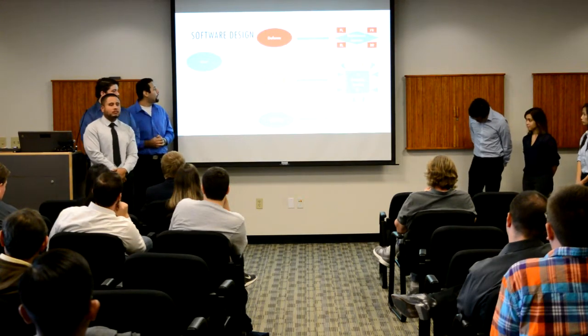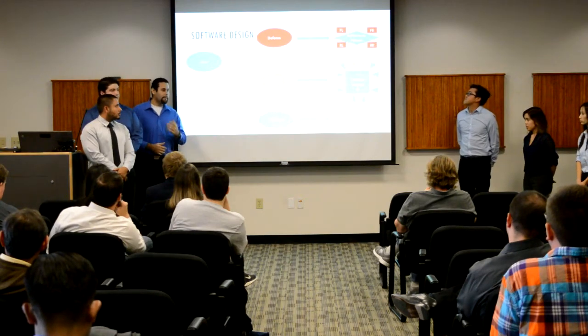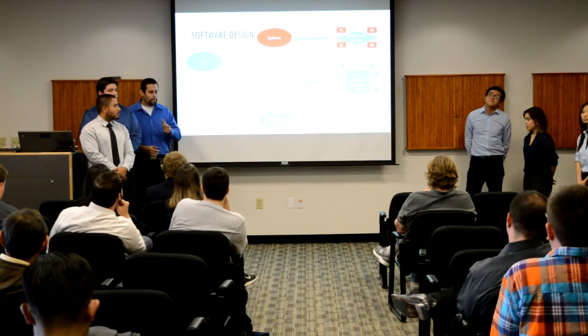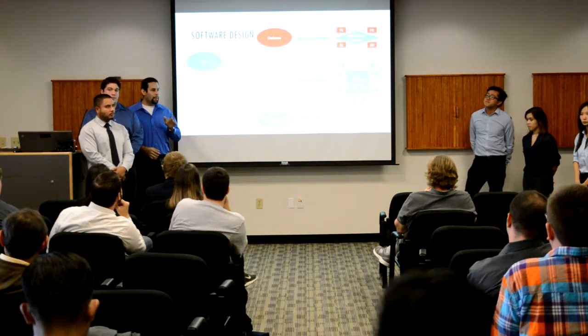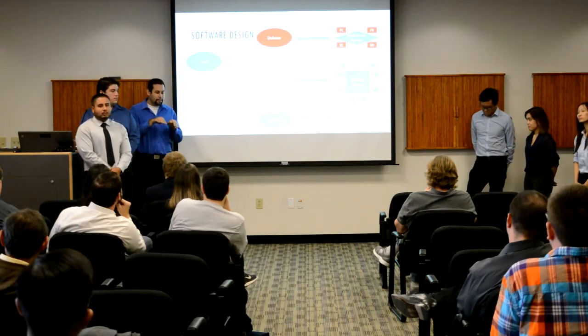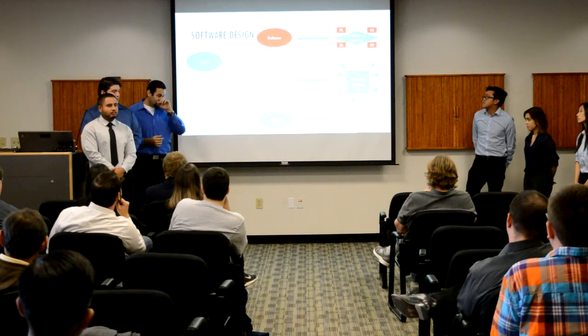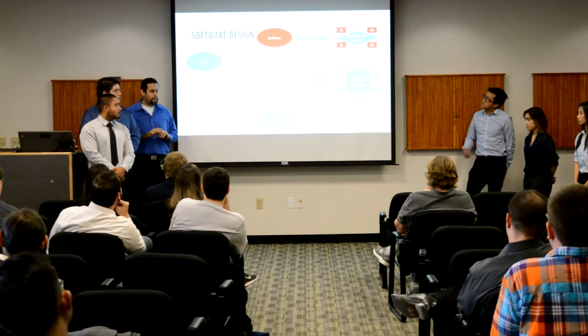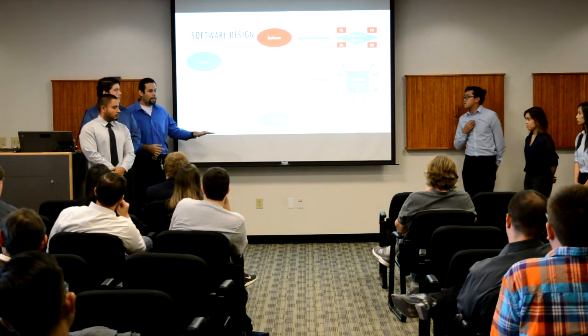And at this point in time, we'll go from the start state into the roaming search state. The roaming search state will constantly roam in the ring and actively look for the opponent. We did modify the proximity sensor positions a little bit so that we could strategize with it. This will be talked about later. But for right now, in the roaming search state, if any of the proximity sensors do detect an opponent, then we go straight into the offense state.